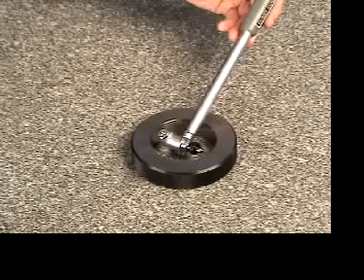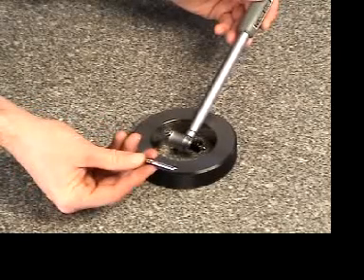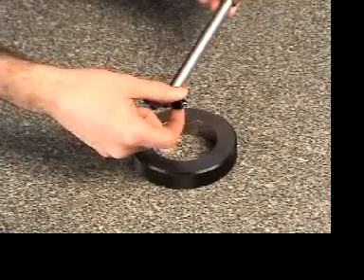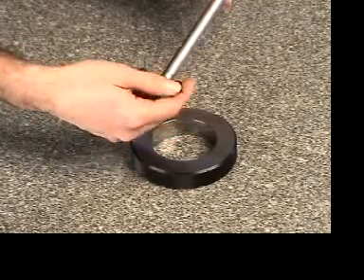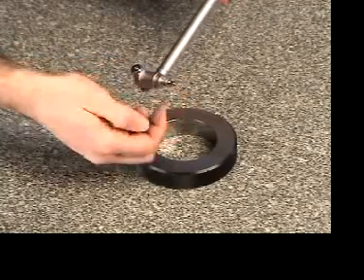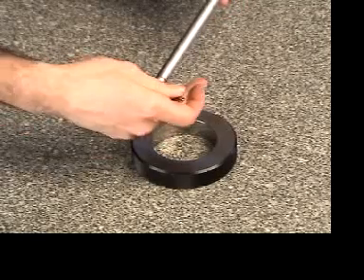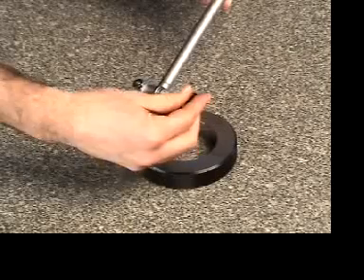To master to the selected ring size, the appropriate post must be chosen to fit the internal diameter of the ring. Remove the knurled nut off of the measuring head and simply exchange out the old post with the new one and re-tighten the nut.